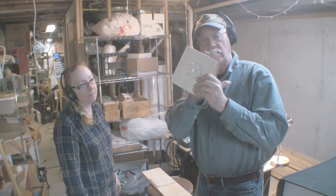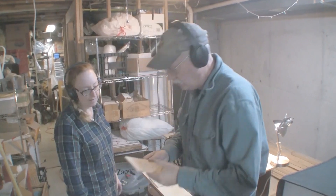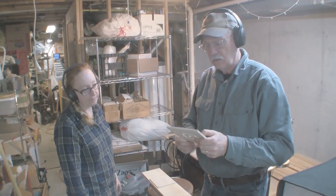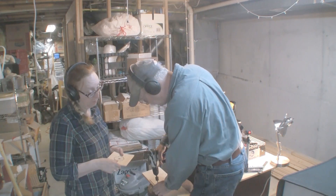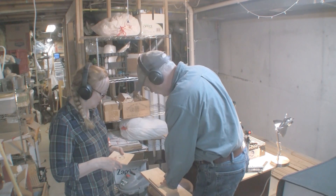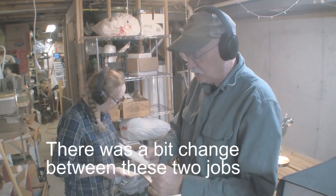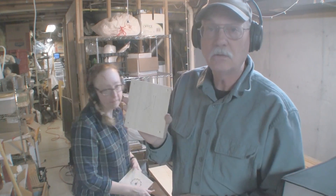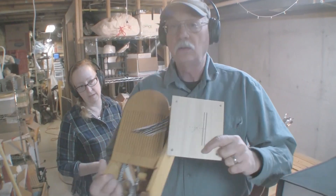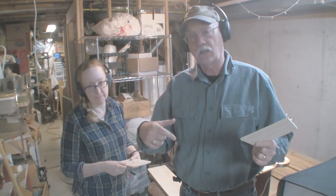See? It matches. This will eventually be out of half inch stock, but I think I'm really happy with that. We didn't go full cut on the heddles because we discovered it's very slow, so I've got to adjust the cutter speed safely. Keep in mind this is just a test piece, but look at the precision — it's got the holes drilled nicely and beautiful cut grooves, and it matches. This is what it's finally going to look like eventually. Cuts number one, faults and all, from our new CNC router cutting machine.